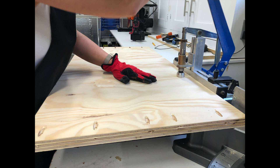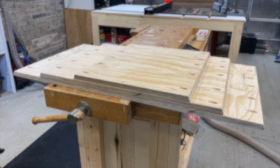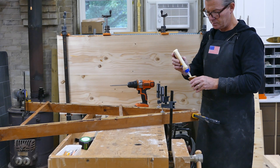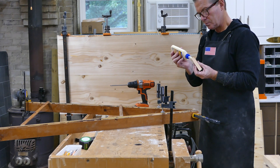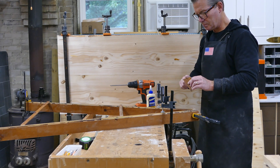We are going to attach the floors to the roof framing and the front and back walls using pocket holes. Kathy loves using the Kreg pocket hole machine. Here you can see all three floors waiting for more pocket holes. For the roof framing, which is also the side walls of the A-frame, I used some refurbished two-and-a-quarter inch 1x material and basically made two face frames connected with pocket screws.